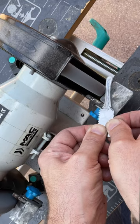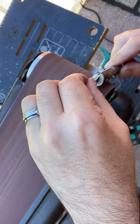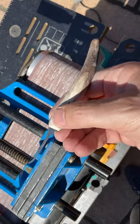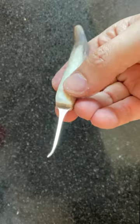I shaped a lockpick — a short hook — using a couple of grinding wheels, then punched a couple of holes into that lockpick before sanding the whole thing down into shape. Lots of vigorous polishing down to about 10,000 grit, and you can see it's looking very shiny at this point.